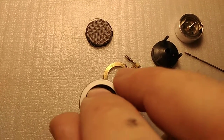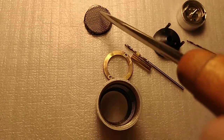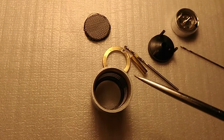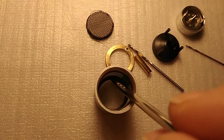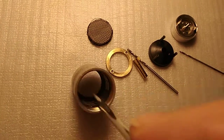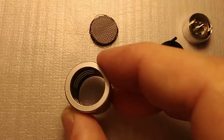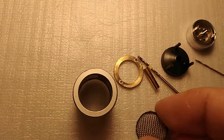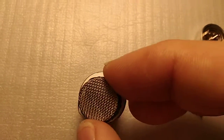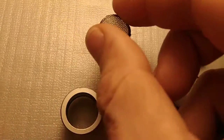I pushed the mesh with my knife inside, squeezed it, and cleaned the residue of glue which keeps the mesh inside. Using a sharp tool, I scraped some residue of the glue little by little and brought the metal surface close to the possibility of the mesh contacting the metal. Then I put it right back inside and found that the mesh was already touching the surface of the microphone case - now it's grounded to the metal case.